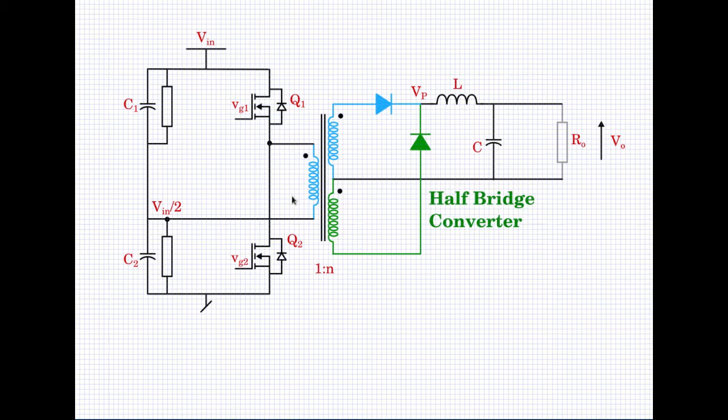The primary voltage switches between +VIN/2 and −VIN/2. During the time when both Q1 and Q2 are off, the inductor is freewheeling, as in the push-pull case, dividing the current equally between the two halves of the secondary. The MMFs cancel, so the voltage across the secondary is zero. Because flux is not changing, dΦ/dt is zero, and therefore the voltage across the primary is also zero.